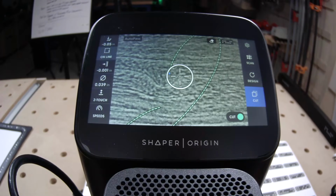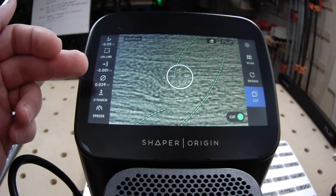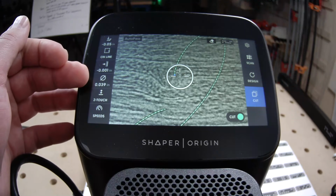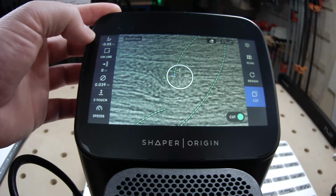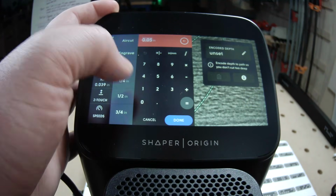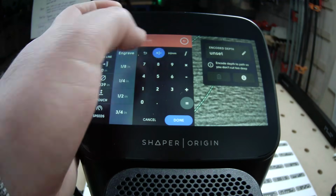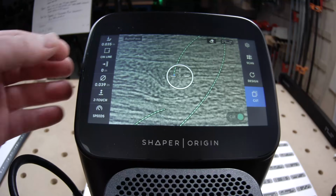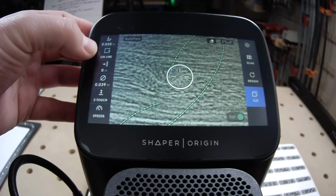Let's hop into cut. I have all my cut diameters, my actual bit size, which is 1 millimeter. Offset does not matter. Our cutting depth is... let's do 0.9 millimeters, so we have just a little bit left to get some hammer contact on that. 0.9 millimeters, which automatically converts to inches if you so desire. And everything is an online cut.